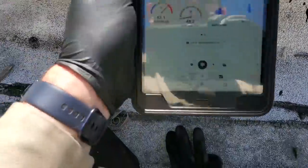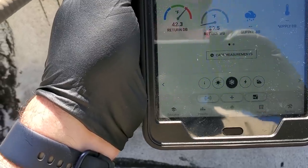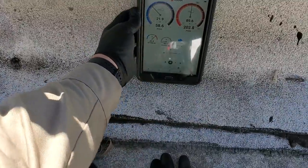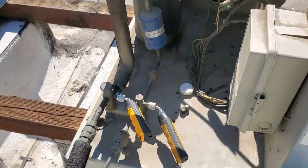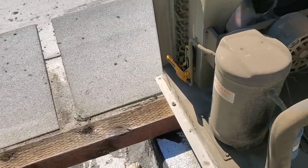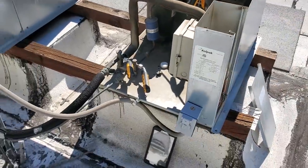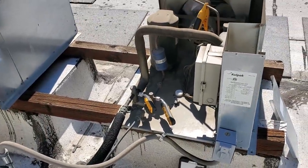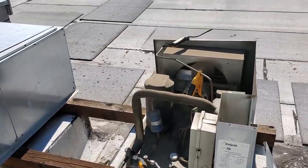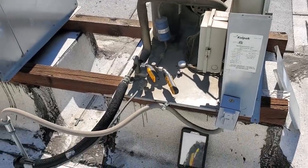We just turned back on. Box temp came up to like 43 degrees this time — that's interesting. Kind of makes me wonder if we have a temperature controller issue. The first time we came on at 39 degrees, this time we came on at 42 degrees. Makes me wonder about the temperature controller — maybe we have one that's starting to fail. So we're going to keep watching the box.